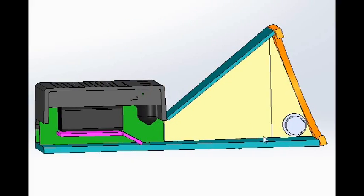Here we have a cross section showing the airflow from the fan being necked down to come down under and slip up through the baffle, which forces the air to come up through the heat sink and back out. If we didn't have this baffle, the air would just freely run underneath and wouldn't be forced to go up through and actually get the maximum amount of contact through the fins of the heat sink.